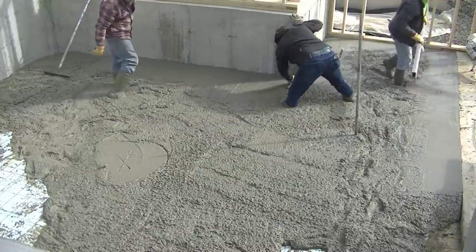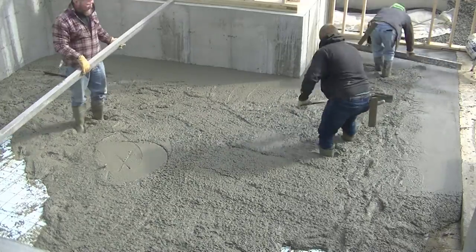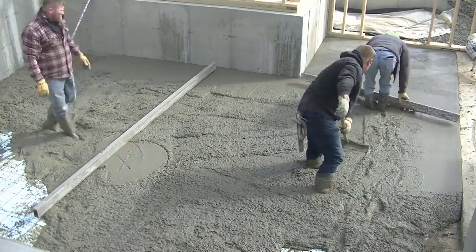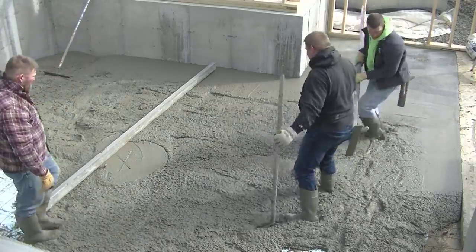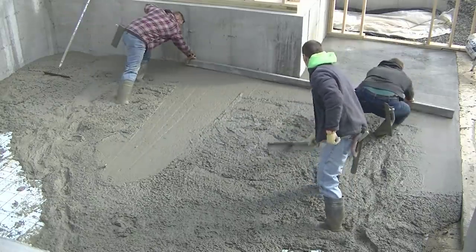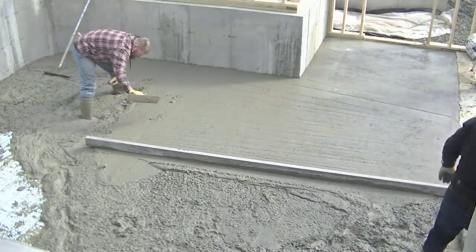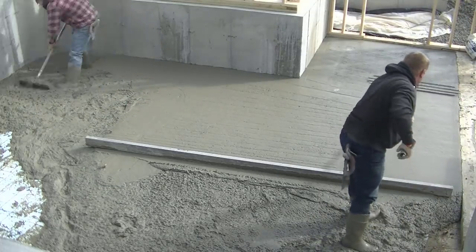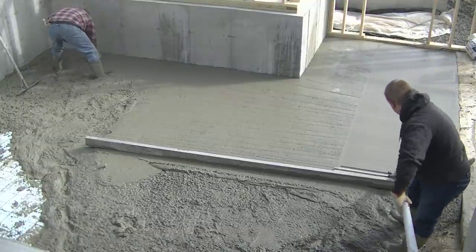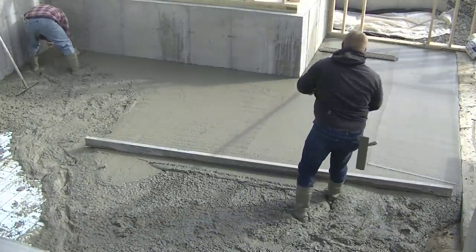The concrete was really hot — 4,000 PSI with hot water in it at about 150 degrees, and it had about a two-hour drive to the job site. By the time it got here and we put the accelerator in it, we could feel it starting to set up on us a little bit, so we're kind of hustling. You don't want to give it too much time down there, otherwise you'll have a hard time screeding it and then a really hard time bull-floating it. Darren and Luke are going to stay and finish this by hand — just need to get it smooth enough to put flooring over it. They'll do a good bull float so by the time they get back on it with a mag and hand trowel, that part will be a little easier.